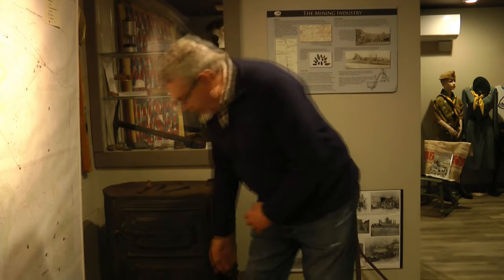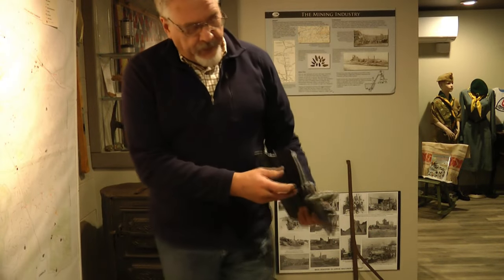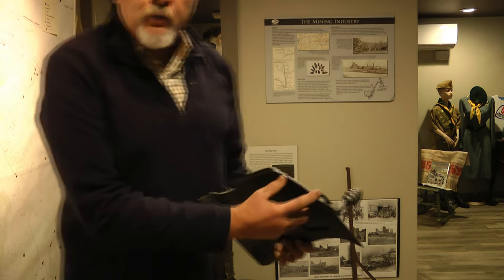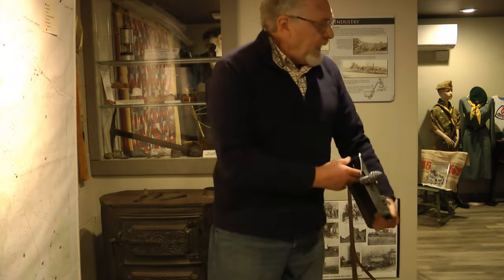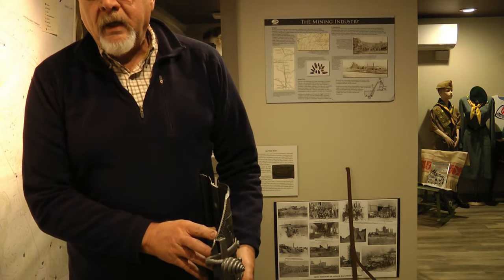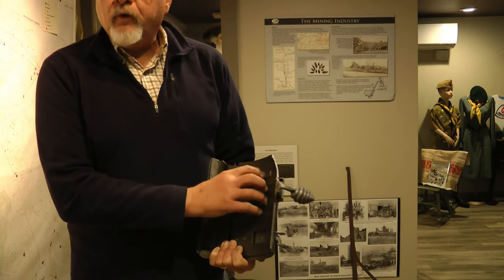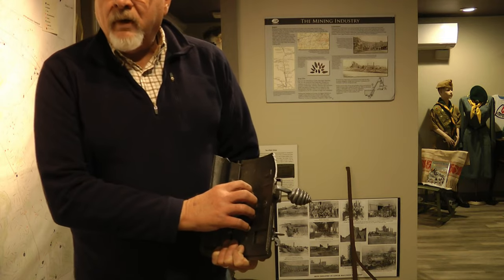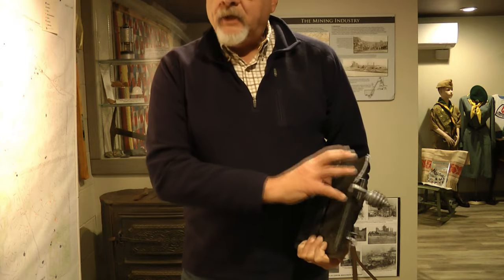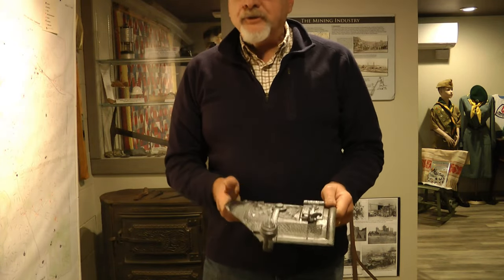The way they could tell it was gray iron was that after it was melted, if it was broken, it would leave a gray break area. That had to do with the grain structure of the cast iron itself. If it broke and it was white, that meant there was still too much carbon in the iron. But the good thing about white iron was that it was very good for abrasive areas. If they had a plow shear or an item under a lot of wear, they could use that iron as a wear material, whereas gray iron was primarily a structural material.